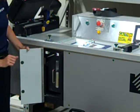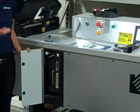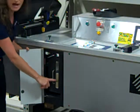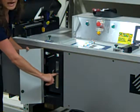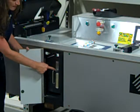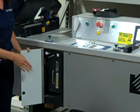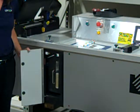A couple of tips to remember: this bagless vacuum system is connected to the blade and it is taking the dust from the product as it's being cut and collecting it in this box. A good best practice is to take a sharpie and mark the halfway point of your spy glass — you can see right through this box. If the dust exceeds that halfway mark, it needs to be emptied. This should be emptied daily, but especially if it's exceeding that halfway mark, it should be emptied more frequently.